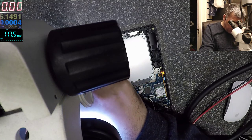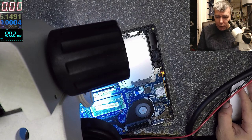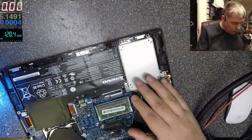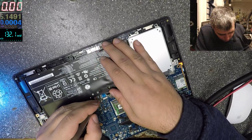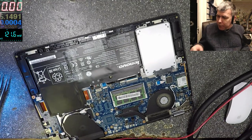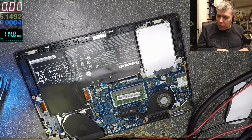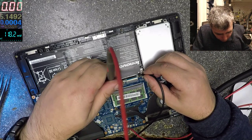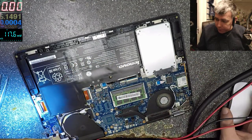Let me take out the battery. Maybe we have a shorted RAM memory, which I don't think, but it can be. Let me unplug the battery. Sorry. Let me get out the battery. The battery is out. Okay, let's come with the power supply. Let's say 1 volt. 1 volt on that coil, 1 volt on the RAM coil. And it's taking like 200-300 milliamps, which I think means it's not shorted. On this case,